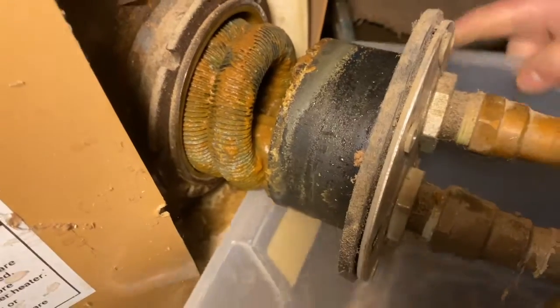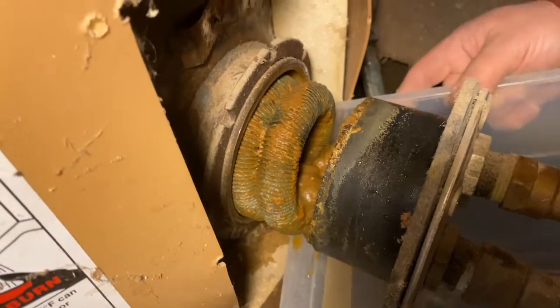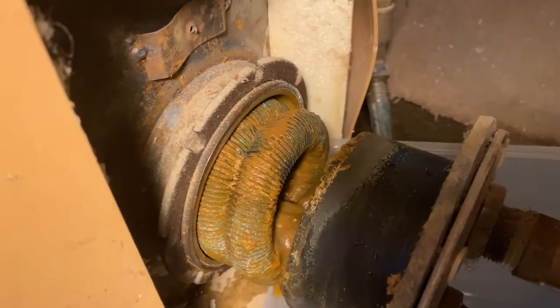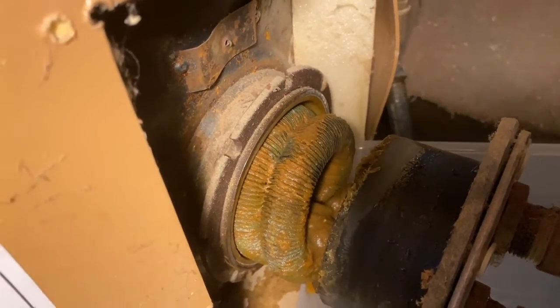You should actually cut these pipes. We just want to do a quick fix because we actually thought about just tearing this whole water heater right out of here. But I'm going to pause the video for a minute here — we'll get this out the rest of the way. You can see all that sludge caked around this coil. The hot water is going through that coil but it can't transfer heat to the tank water because it's trying to go through so much sludge.